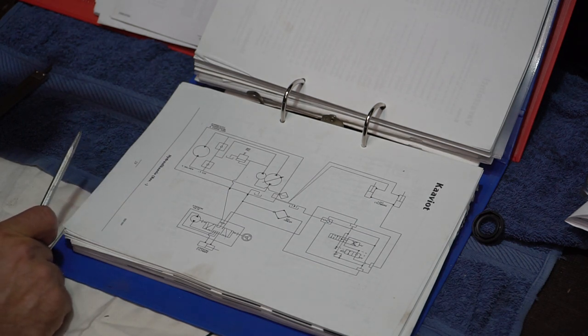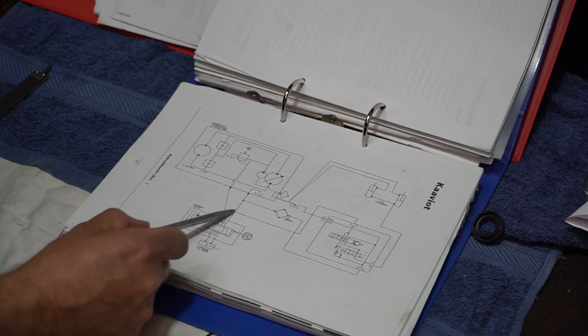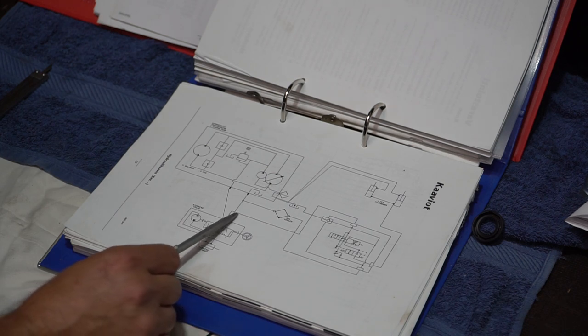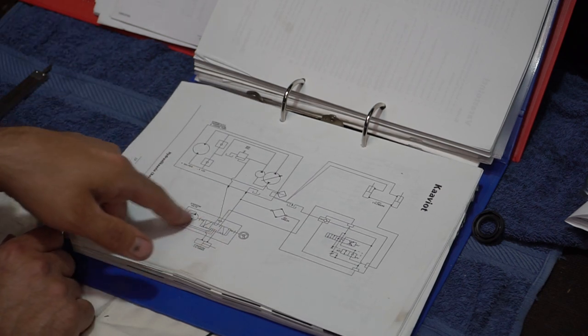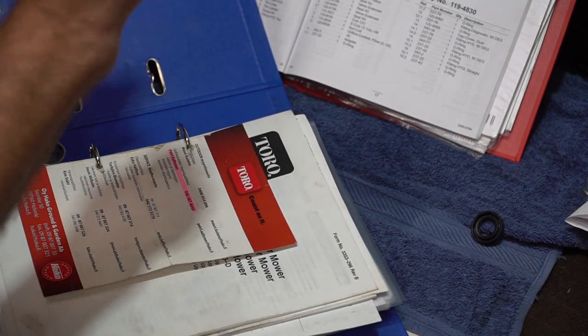And the next thing we have been able to do with our gadgets is that we blocked this tank line connection from this Orbitrol. And by doing that, we were kind of nasty, or naughty ones, and forced the oil to go to the lifting valve. And it kind of worked during those couple of seconds. So now the best hope is that we are having the fault in this Orbitrol valve. Fingers crossed.